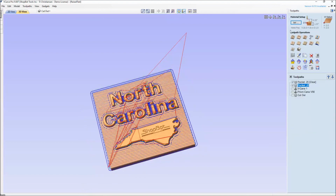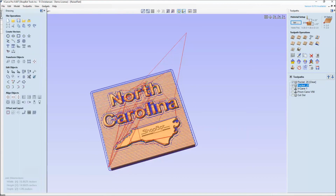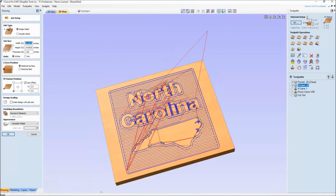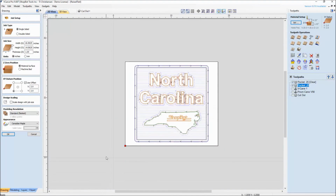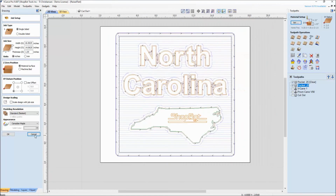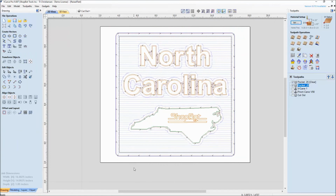So as you're working through the software, both on the drawing and the tool pathing side, you're going to start finding tips and tricks that work for you. Know your material, know what you're working with, know your ShopBot, the size of your machine. Notice that when I put the offset in way back at the beginning, at the XY datum position, I marked that in from my X over to and up to. I could have clearly left that off, with no offset in this software, and then just on my ShopBot itself, made a temporary 0,0. So start playing around with these different things as you're working through these projects.